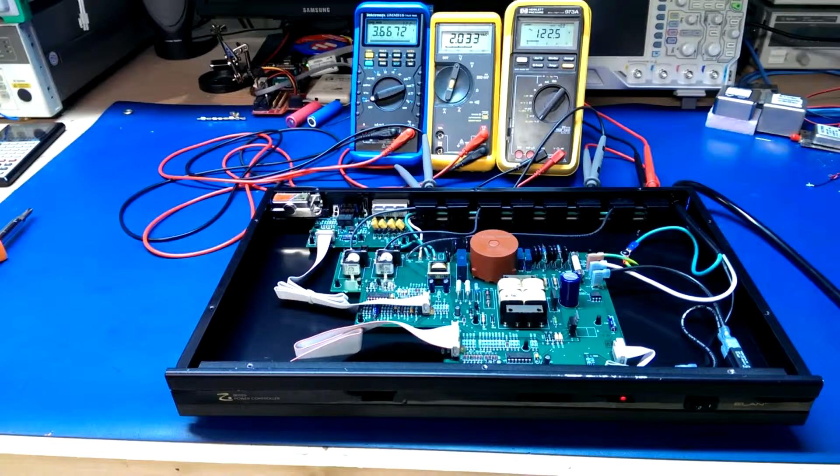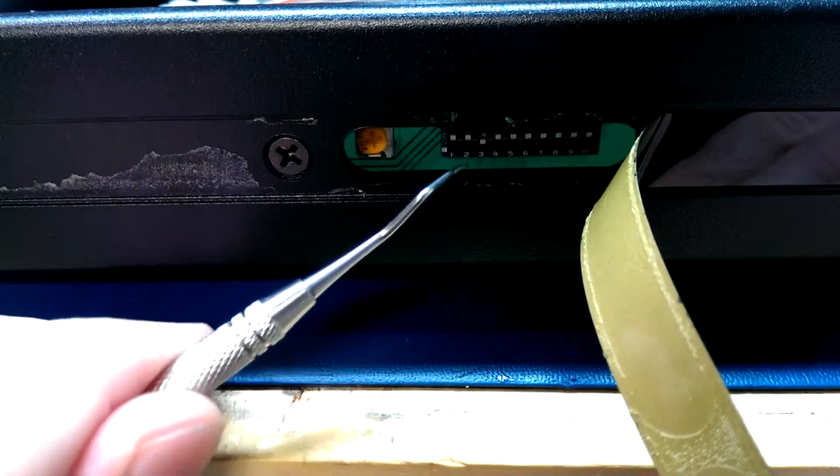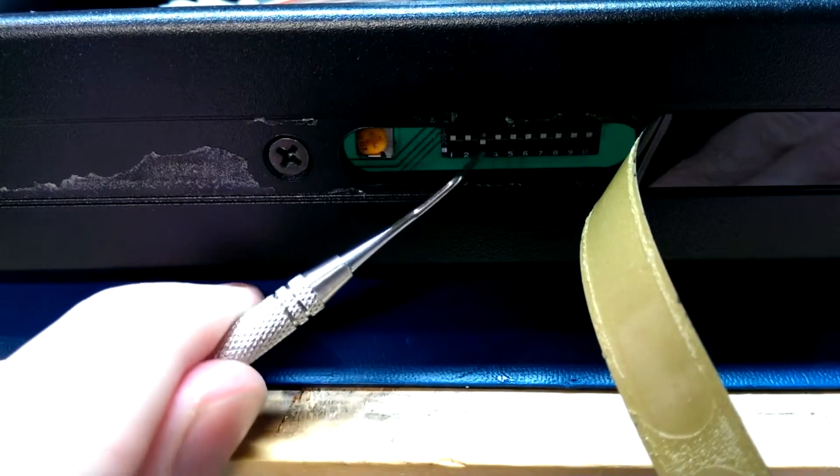There are a couple of LEDs on the front panel — green ones are supposed to light up indicating the unit is operating correctly. It's been at least 20 seconds, so that's a no. Let me take a look at the switches again. From memory, I recall all the switches need to be in the up position for the default settings. Switch number three here is actually down, so I'm going to flip it up, power this thing back up, and see what happens.